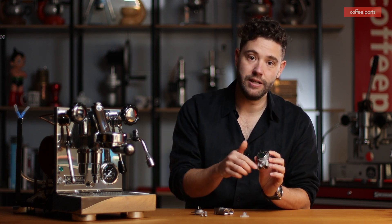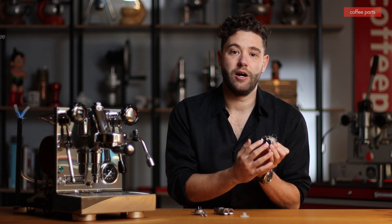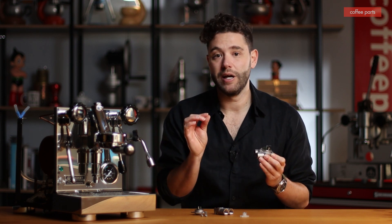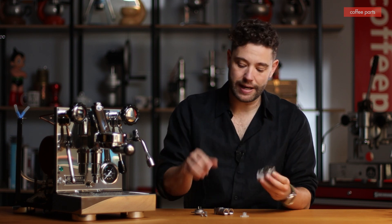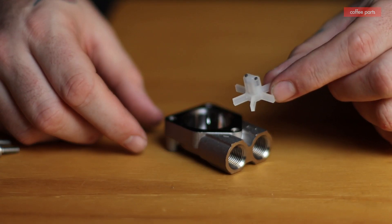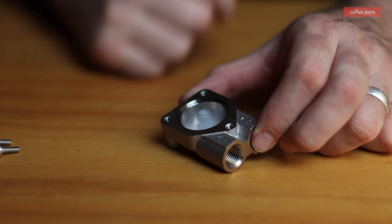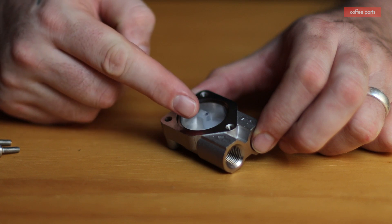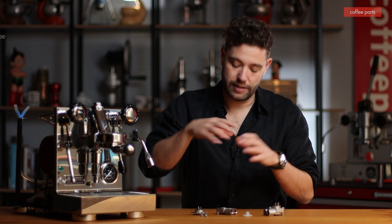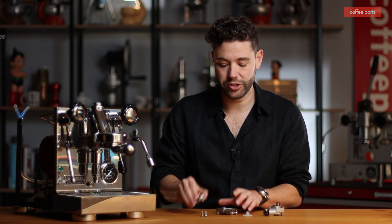Water goes in and out — there's a little arrow for in and a little arrow for out. Generally they're either a quarter inch BSP, or some are smaller at one-eighth inch BSP. Inside them they have a little impeller with two little magnets. As the water flows, it forces the impeller to spin. Because they know how much water fits in each area and how many times the impeller spun, those magnets register and the device counts the revolutions.